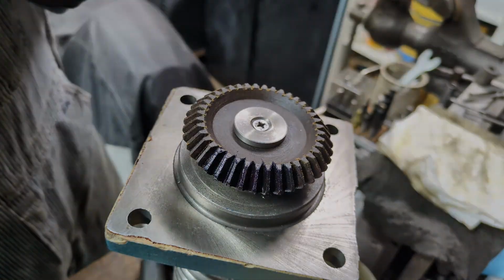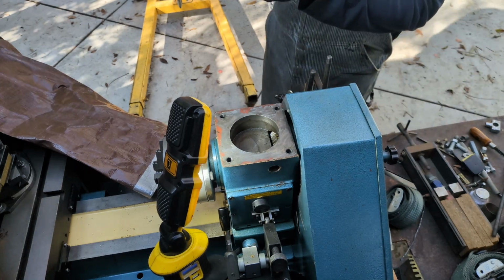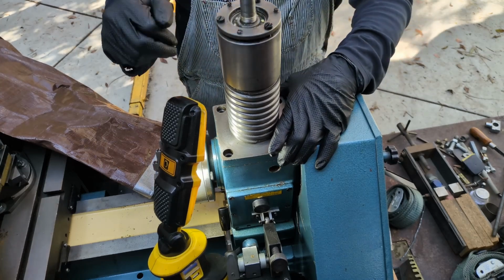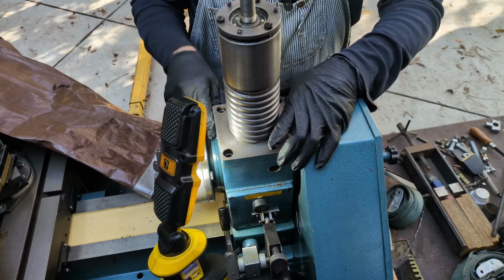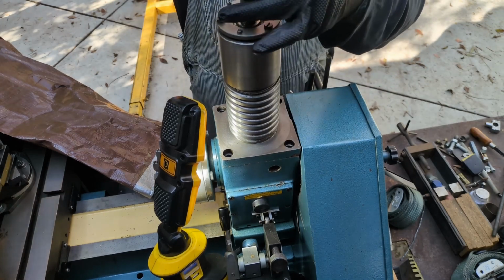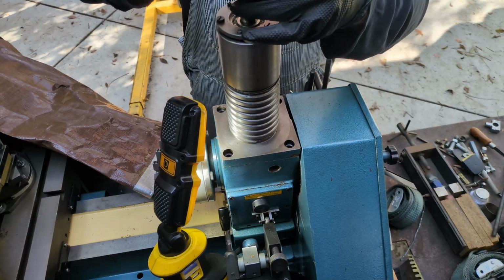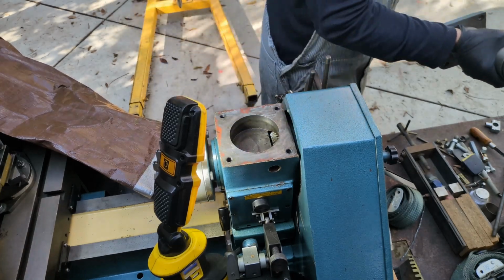All right, let's head over there. We're going to lower the tower on. I'm going to do it so that the blue is not touching the gear. So the blue is over here now. And then I'll just rotate it 180 degrees. I don't know, in this case, I don't think it's going to make a difference to bolt this down. I could be wrong. So I'll just turn it through its paces 180 degrees and see if that is enough to imprint.